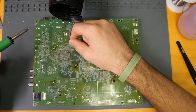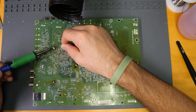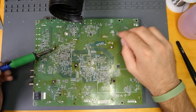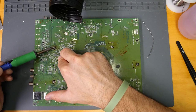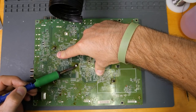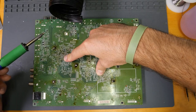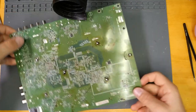The way I like to reattach these heatsinks is one pin at a time, starting with the ones right next to the BGA chip. I'm going to add a lot of solder and then press down on it to make sure it's nice and flush, making proper contact — putting pressure on both of the chips. We've just installed the heatsink back on.